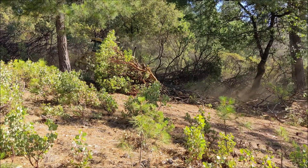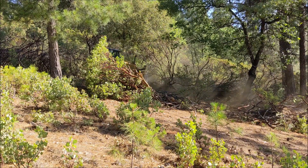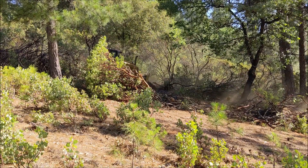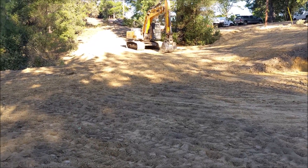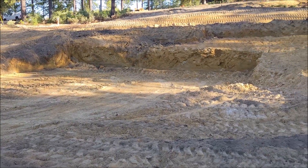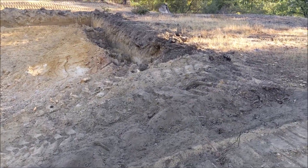Stopped working on the pad for a couple of days to put the septic system in. This is clearing a little bit for the septic system — I'll do a separate video on that as well, just thought I'd put it in the timeframe here. Making sure all of the dirt is watered down well and compacted well to drive over. It's a long process, but really key so there are no future cracks in the house and no settling of the dirt. That's a pretty good overview of what the foundation looks like and the wraparound.